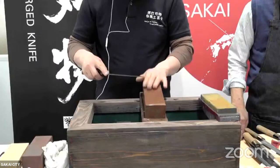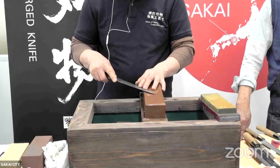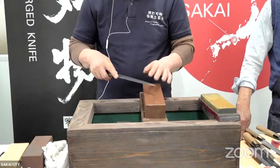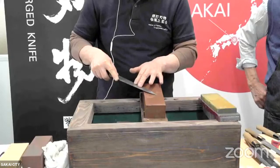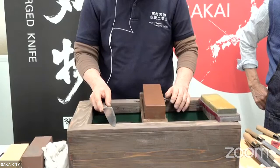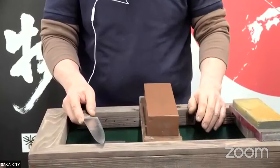With stainless steel knives, a 1,000 grit sharpening stone should be adequate. I think the problem may be the angle. You might have sharpened the edge at 15 degrees, for example, and the middle at 30 degrees, just as an example. But if you've changed the angles during the sharpening steps, then it would yield a poor result.